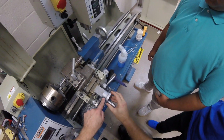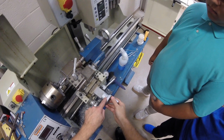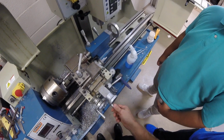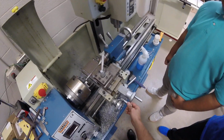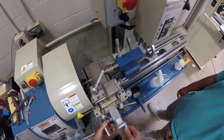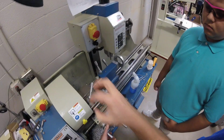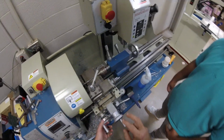So we'll do 10 thou at a time, and we're going to go all the way to 60 thou, okay? That's where that cutter's going to be when we have everything rocking and rolling, right? So here's my Z travel, okay? For this, we're going to come all the way down until our tool touches down here. Once we come off of here, we're still safe because our tool's not hitting the head of the lathe. We do not want that tool to hit the head of that lathe because that will shatter that tool, and it could wind up in your skin, my skin, ceiling, holes everywhere, okay?